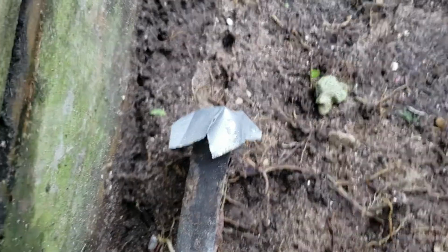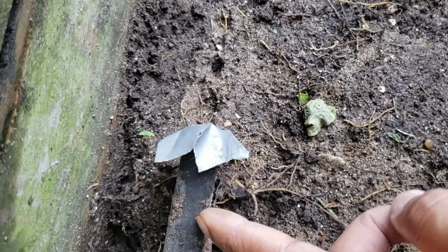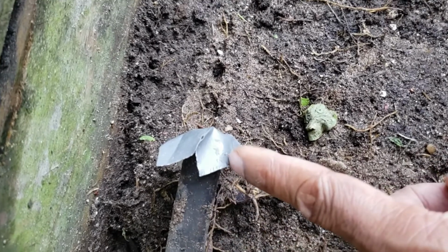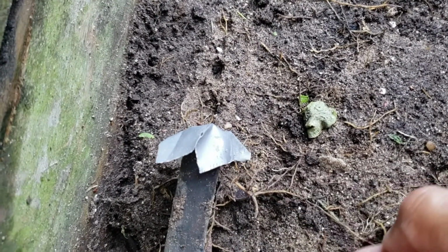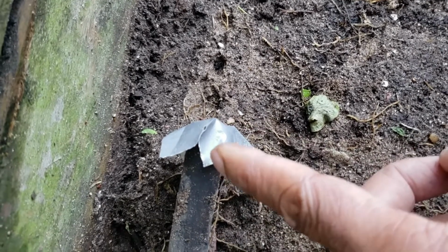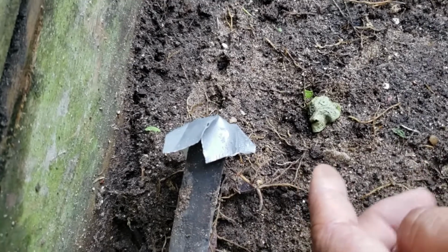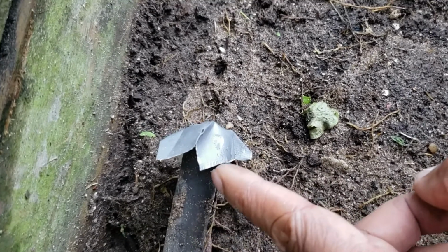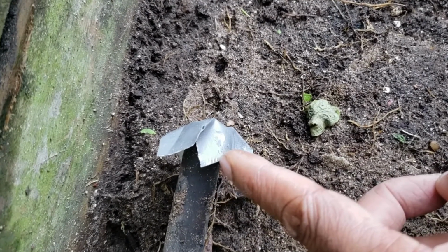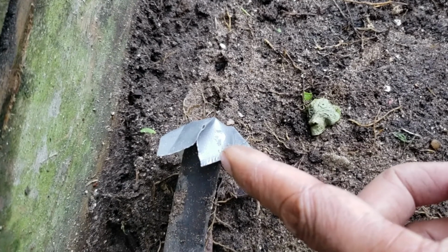Oh, by the way, I forgot to mention, when you have an exposed pipe, especially in the southern climates, you might want to put a piece of tape on it so you don't get the lizards in here. Or what would happen, a lizard will get in here, you'll seal it up, and the lizard would die and then disintegrate, and then all your nozzles will get clogged up. Not all, but some of them at least. So you want to make sure you tape this up when you cut it, especially if you're leaving it for a while.